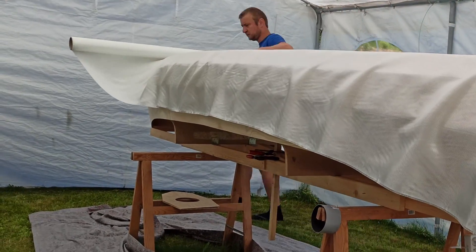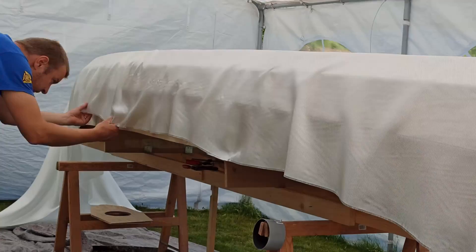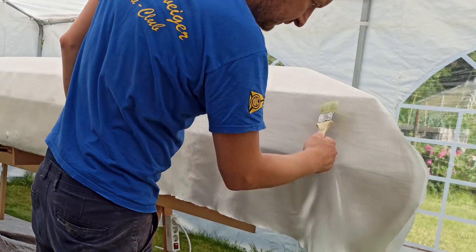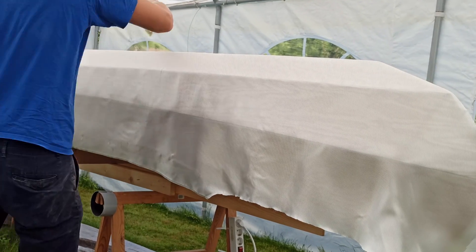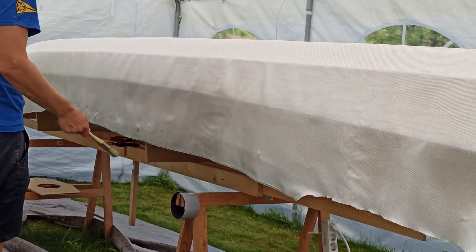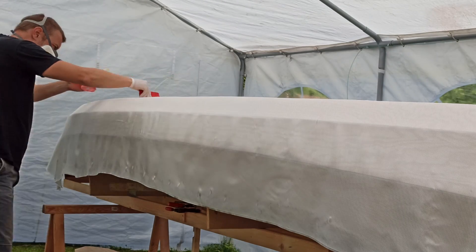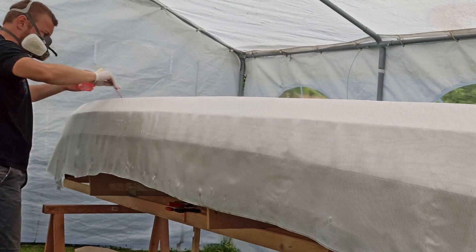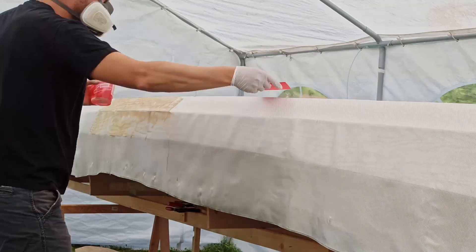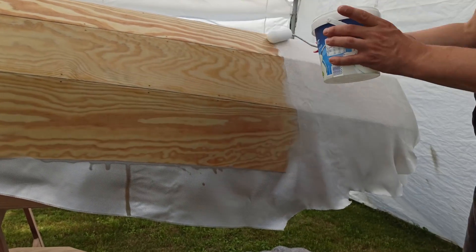In the first step I laid a fiberglass fabric on top of the boat with a weight of 160g per square meter. I tried to lay it as flat as I could and cut off the overhanging edges. This time I mixed non-thickened epoxy and spread it with a plastic spatula. Later I found out that I am more the rolling type of guy, so I finished spreading the epoxy with the roller. After this layer was cured I rolled two more epoxy coatings on top of the boat.